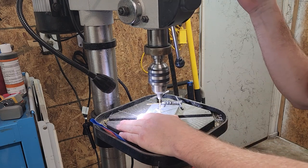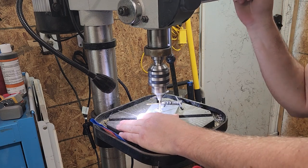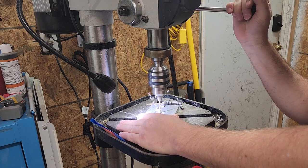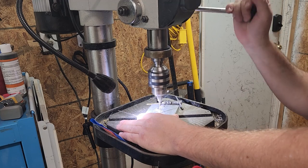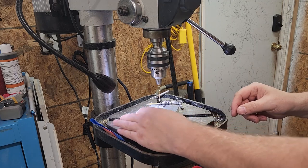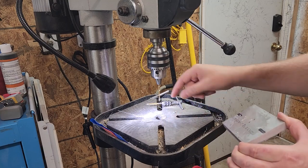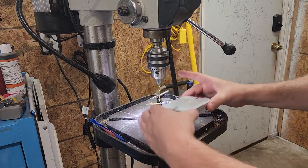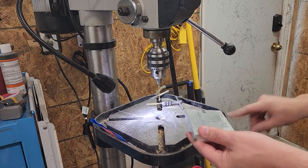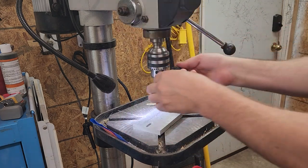The reason you want the quarter-20 hole to be as centered in the material as possible is because that's going to be your anchor point for the camera stand. You want it almost balanced — if it's off a bit, your camera might sag to the side. You can see the material got picked up because I didn't break my chips often enough. See how long those chips are — they started winding around the drill bit and wanted to lift my material. I was talking to the camera and it distracted me, but that's our primary pilot hole done.